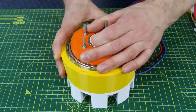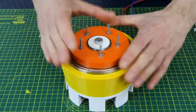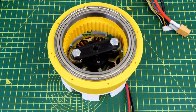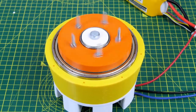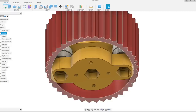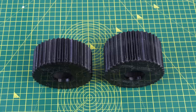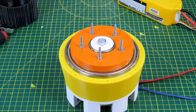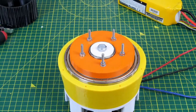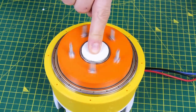However now if I try to stop the whole thing with my hand it doesn't stall the motor — we can still see that nut in the middle going round which means the motor is turning but it's just skipping, meaning the wave generator is just driving over the bumps. So I made a new wave generator with the bearings moved very slightly apart by only about 0.4 millimeters. However now it barely runs at all, probably just due to that minute extra flex in the flex spline and the way the teeth mesh — it's very hard to predict what's going to happen because we don't really know how it's going to flex when we draw it. I tried moving the flex spline up so it only covers the bottom bearings and only flexes right at the bottom, giving a much shorter flex spline by about 10 millimeters. This runs a little bit better but at high speed it all stalls — I think that's probably because it's just distorting in a really funny way. So we're back to the original wave generator with just one bearing fitted, the original long flex spline, and the outer casing with the teeth missing at the top, and that seems to run pretty much okay again.